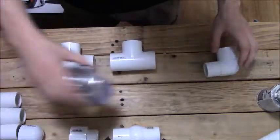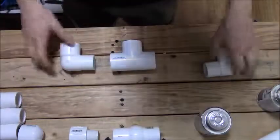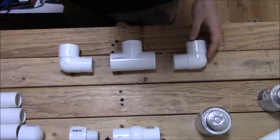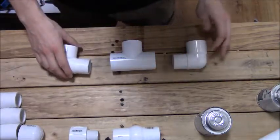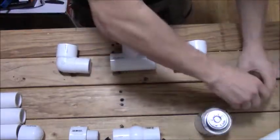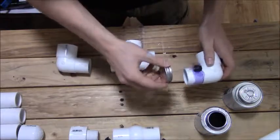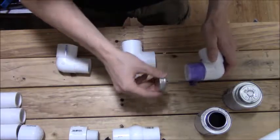The first thing you're going to do is take your PVC primer — it's a very strong smeller. I'm going to build it in sections, starting with the T joint to build the pressure chamber and work my way up from there, bottom to top. That way I don't get confused and glue the wrong thing to the wrong piece. You've got your purple primer and your PVC cement. Always start with the purple primer — make sure the joints are clean, it makes a better seal so you have less leaking.